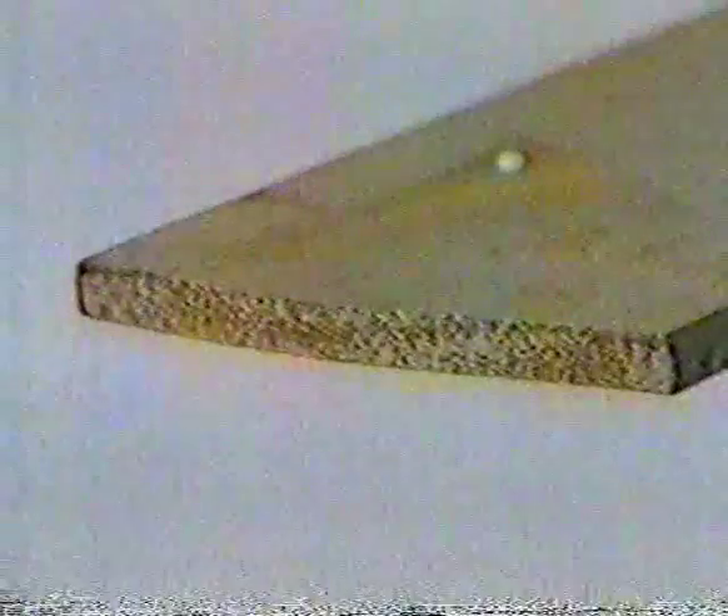The process is known as rolling. By rolling steel, you can produce rods, bars, plate, and sheet. At its simplest, rolling is the squeezing of steel between pairs of specially shaped, solid, rotating cylinders — they're called rolls. Rolling calls for steel with good malleability, and the hotter the metal, the more malleable it is.